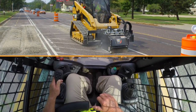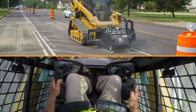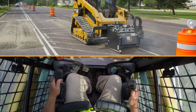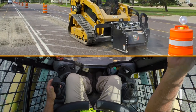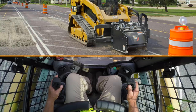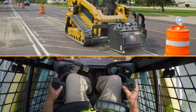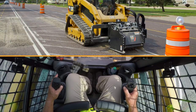Now we're getting to the end of our cut. I'm going to slowly start raising the head of the tool to make a nice smooth contour coming out of the asphalt. We've made that pass. I'm going to idle the machine down. Then I'll take the right roller switch on the right joystick, pull down on it, and that discontinues the continuous flow. You can also deactivate continuous flow by hitting the continuous flow switch, but then you would need to reactivate it when ready to run again.